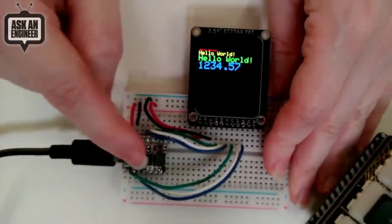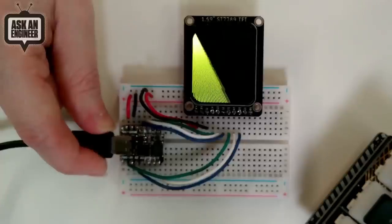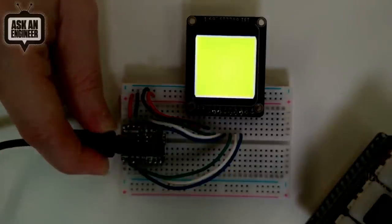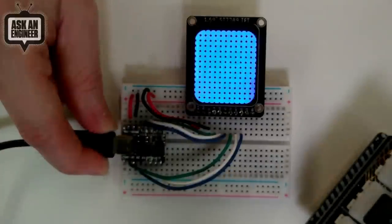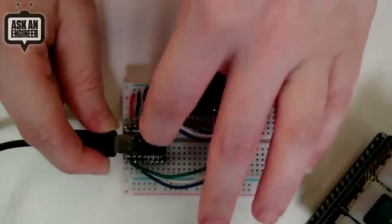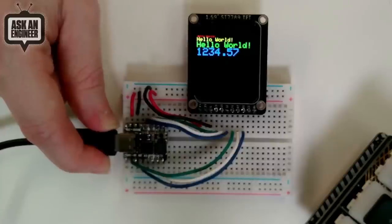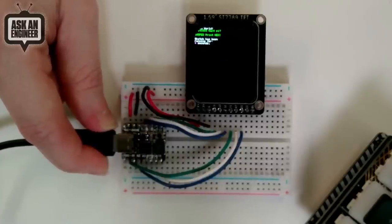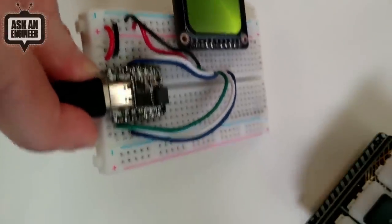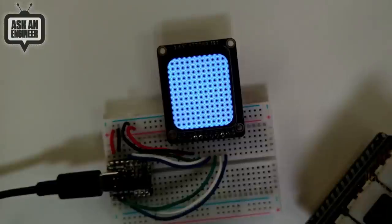You can see how it cuts off at the corners. People ask if you need special memory mapping — no, you write to it like a square display; the corner pixels just don't show up. You could use it for a smartwatch, but it also just has a funky look to it. Use it like any other ST7789 display — nothing special. It's 240 by 280 pixels and an IPS display, so it looks good even when you're viewing at an angle.